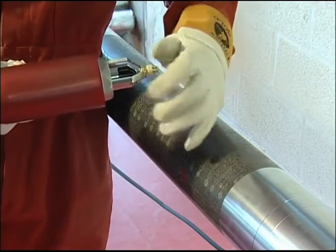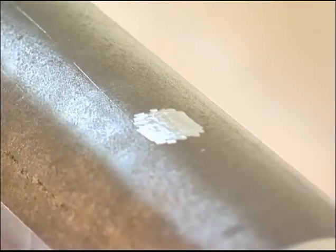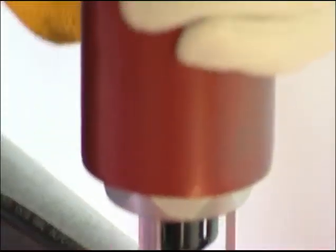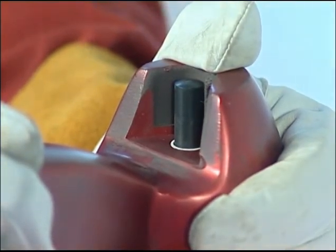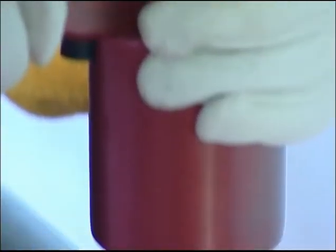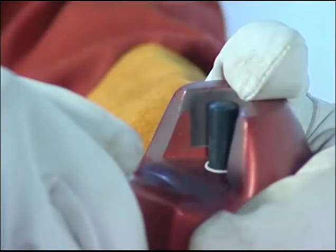Insert the ferrule with the serrated edges outward. Again, this must be a tight fit. Place the pin tip directly against the substrate inside the cable lug where required and depress the solenoid fully toward the required braze surface. Without moving the depressed gun, check the adjustment indicator or collar, release the solenoid and adjust as necessary by rotating the ferrule holder.